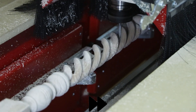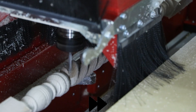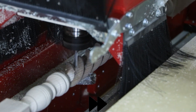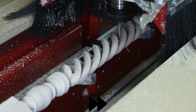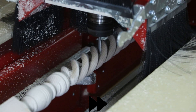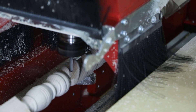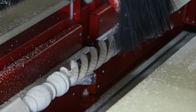Just like the barley twist cutter, this is also taking four passes at delicate speeds to ensure that we minimize vibrations, chatter, and any chance of actually breaking the part during the machining process. Even though this technique looks advanced and difficult to produce, Legacy's Conversational Cam Pro software makes this extremely simple with a one toolpath process. To support our customers and those interested in learning about CNC before they invest in one, we offer online workshops that cover all of these types of details and much more.